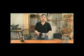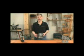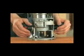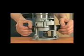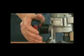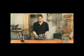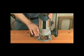Of course, the most important feature and innovation that we've brought to the fixed base in the MR23 series is the trigger control system. This is the first professional fixed base and indeed modular router system to have the trigger in the handle, which is where people expect switches to be from virtually every other power tool. The motor and base go together very easily with this low voltage track system that solves the age-old problem of how to deal with the varying position of the height of the motor relative to the base.